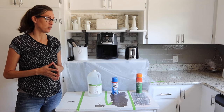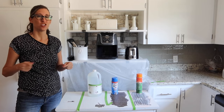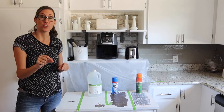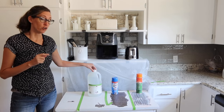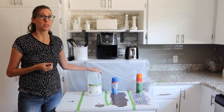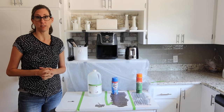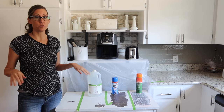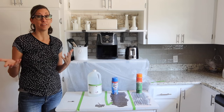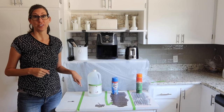The Citrus Strip also took longer and was messier because I ended up having to use TSP or mineral spirits to pull all the gunk up since it really broke down the paint. With the Easy Off, it kept the paint together and just pulled it up from the surface. As for the vinegar and the heat gun, I would only use those for paint drips or paint splatter — I wouldn't use them to remove paint from an entire piece of furniture. But if you're looking for something eco-friendly with no chemicals, those would be the way to go. Overall, shockingly, the oven cleaner worked the best. Thanks for watching, guys — I'll see you later!